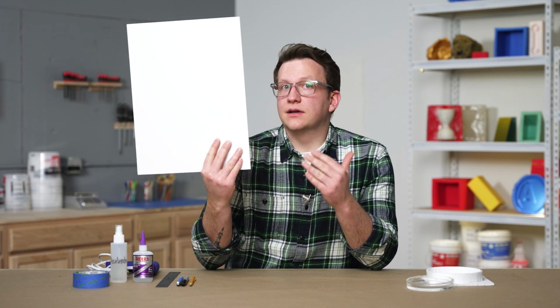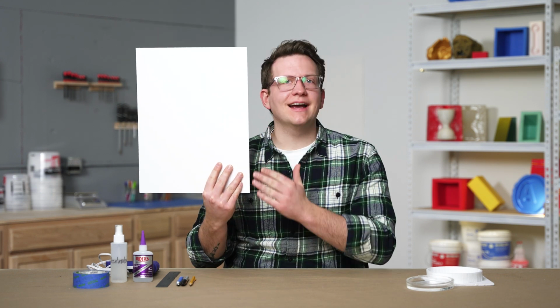Because our tray is circular, we're going to make a circular mold box. A square mold box would work just as well in this situation, but it will require more silicone than we previously calculated. This isn't a big deal, we'll just need to go back and do that calculation again if we choose to do so. To start, let's grab a fresh sheet of foam core. We can see that each edge is perfectly straight. These are called factory edges, and we'll use these to our advantage when measuring and gluing.